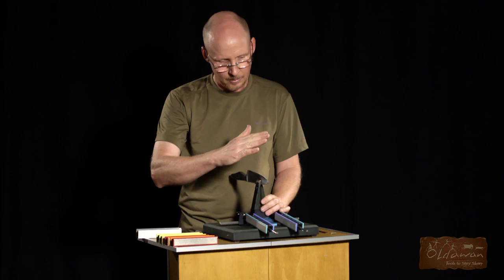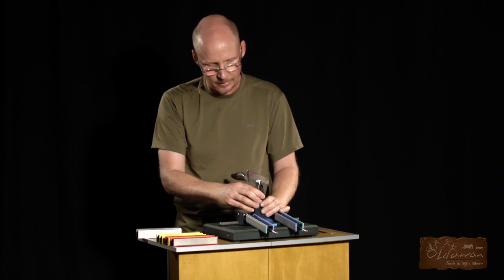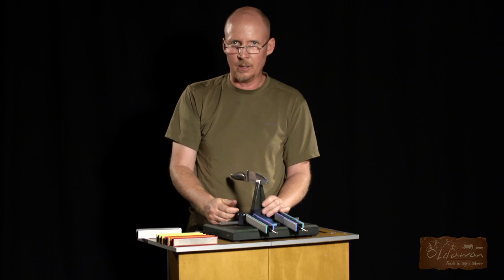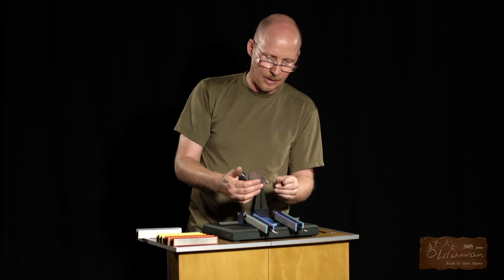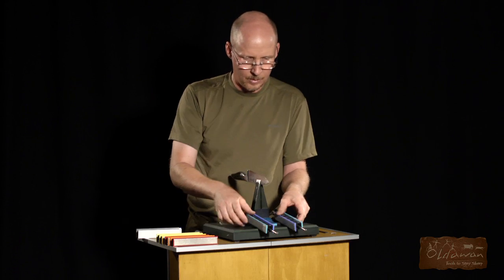And if I come up a little bit on the cutting edge at the tip on the right-hand side, I'm not that concerned about putting a micro bevel on that. I can always come back and clean out that side at the lower angle and make it nice and polished to match. And if it was the opposite case, if this was telling me the knife needs to go forward, I would just stick with the match on the right and work with the angle that I find on the left.